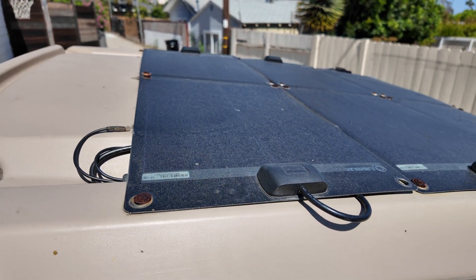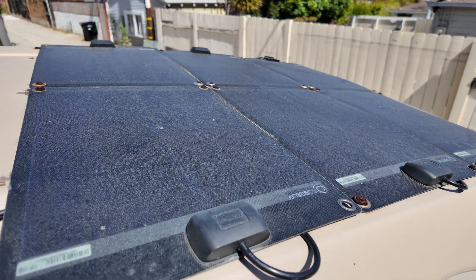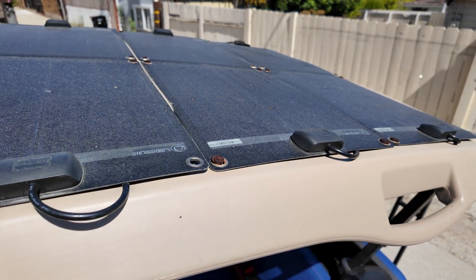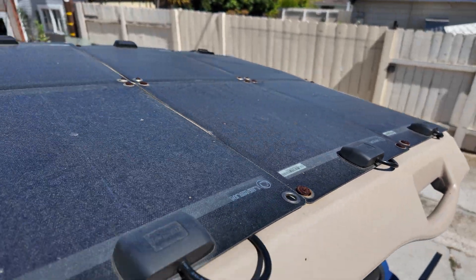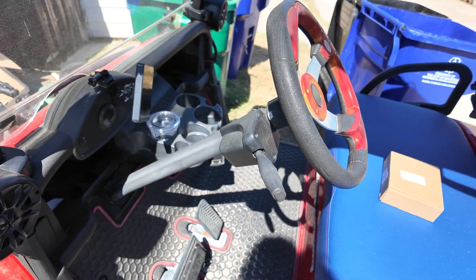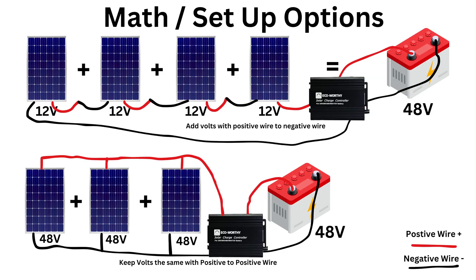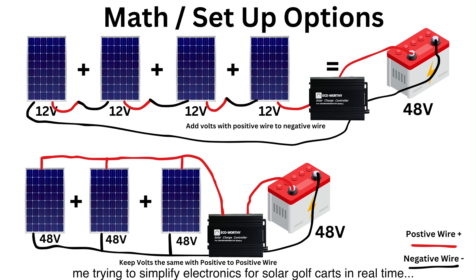You need to match the panels to the battery voltage. I have six panels and each one is 24 volts, so I put them in groups of two - two, two, two - and fed that in. I'll put up a diagram because essentially you want to go series: positive to negative if you want to add the voltage, and negative to negative if you just want to add more of them.